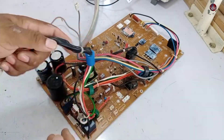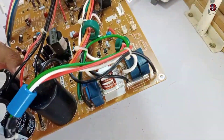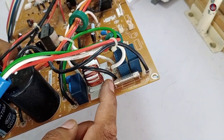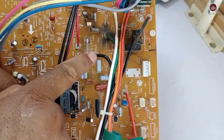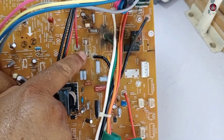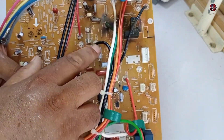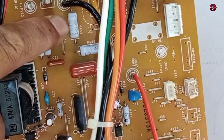Now I will explain how the motherboard will be damaged when the wrong electricity flows through it. This black wire is the input wire. The fuse is installed further which is attached to another black wire. If neutral supply flows here, this fuse will not blow up with the neutral — the hot supply should flow here, which is much better, as it will make the fuse burn quickly and not let the further components go bad. Three resistors are installed in series here.